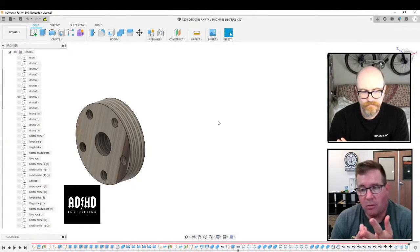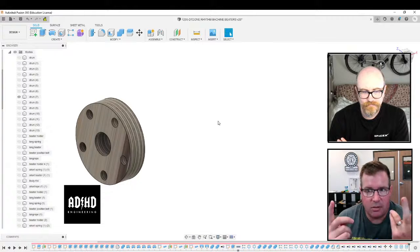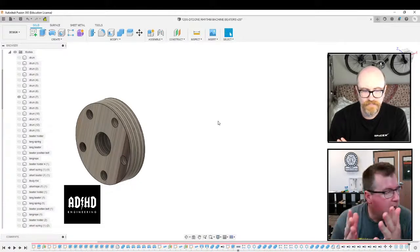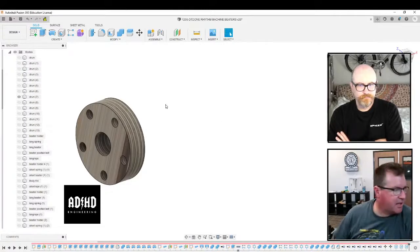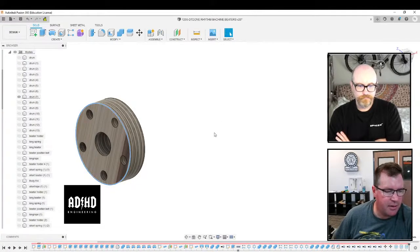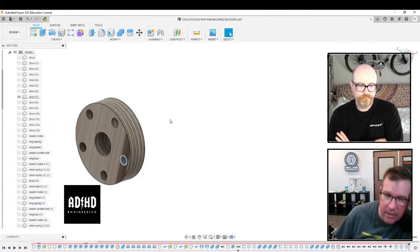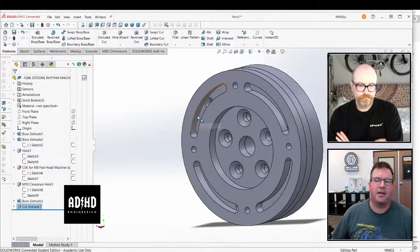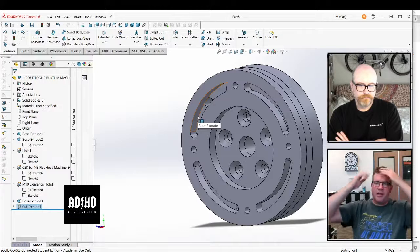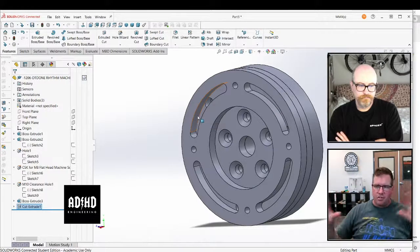I like the idea of using a hole wizard because you can then just edit the kind of hole or add a countersink. I like that, right? So this workflow where I've just been going into the Fusion file, isolating the part that I'm looking at, selecting it to measure it, like, oh, that is a 35 millimeter radius circle. It's a little hard when you want to try to find these bolt sizes. I had to make a sketch to try to find that arc. But I think that's actually better. And then we can just use this as reference and then make it to our CAD standards rather than importing something, making sure you don't do the relations, protect the geometry. It's going to be bad that way.